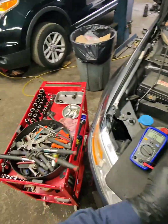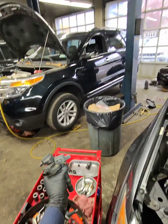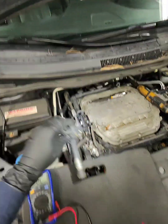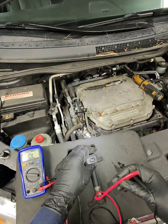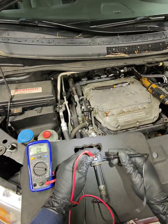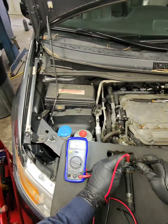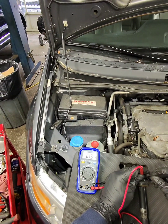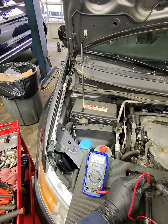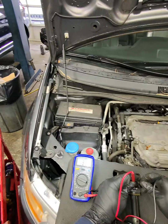1724. As you can see, these three coils are within the same resistance range, and the one that's not working so good has a resistance of 1835 — that's well over 100 ohms difference compared to the others.